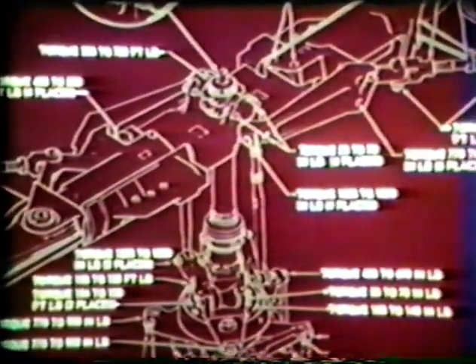Since all the rotating components of the rotor system are subjected to constant vibration, the tightness of the bolts which hold the components in place is of extreme importance. There are 27 fastening points and 14 different torque values. You may remember some of them, but it's doubtful that you will learn them all. The best bet is to refer to the figure in chapter one of the dash 20, where all the values and locations are clearly indicated. Many men make a copy and keep it handy for reference on the flight line.